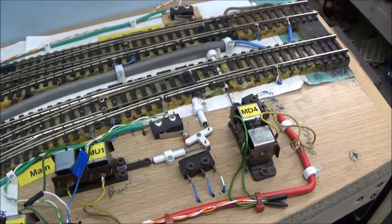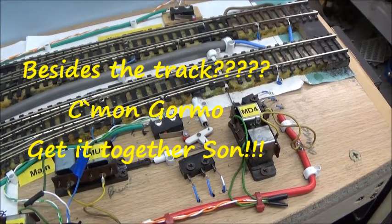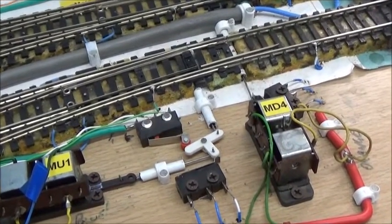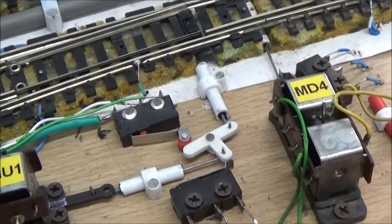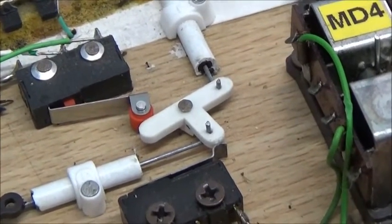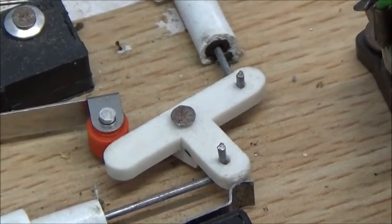This is how they've been applied on my railway. I have point motors sitting on adapter plates beside the track, and in order to place them on a narrow piece of board I've had to set the point motors off at odd angles in some cases. Therefore I need the bell crank for a change of direction to activate the point motor. You can see here as I zoom in that it's quite a simple setup — let's have a look at the modified tile spacer.